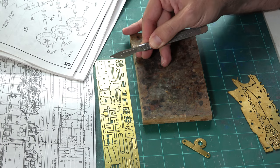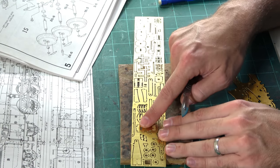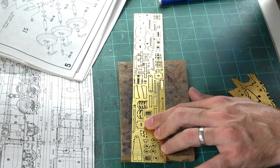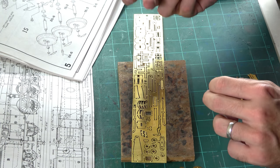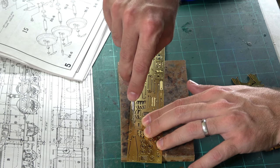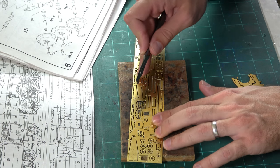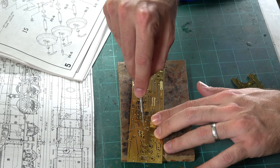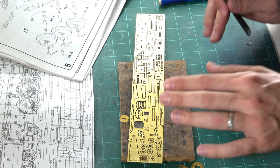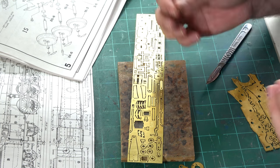The other method is using a really nice sharp scalpel blade. I've selected the right bit we need — it's got an 'F' on it; they're all labelled up so the instructions are quite good on this kit. Just place the scalpel blade up against the part and rock backwards and forwards — you can feel it press through. There we are, that's off. Now we need to clean them up and get the files out.